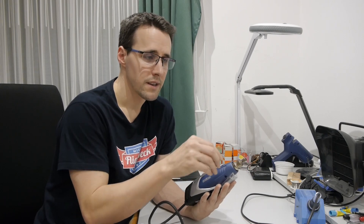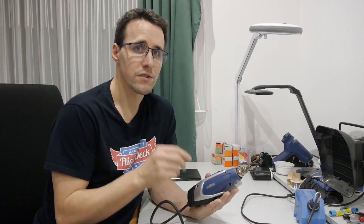Tool number three: my heat gun. Most of the time I use it to shrink tubes to protect soldering points at cables. But it can also be used to heat up wide areas of soldering points to remove components, or to liquefy hot glue — for example when installing switch caps, I use the heat gun to keep the glue liquid while pushing the cap onto the switch. When buying a heat gun, look for a model with a small tip, because normal heat guns designed to remove paint from wide areas are not precise enough for targeting a specific point on a PCB.